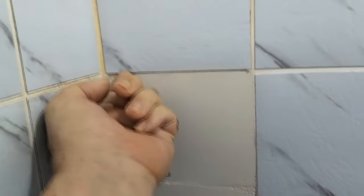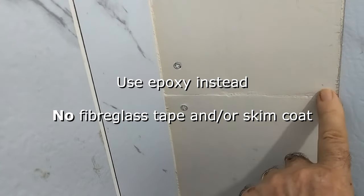Let's see what's happening here — let's get some light. I've been working here in the background and I've learned a lot actually. I assessed that all the tiles getting loose are over skim coating — no exception. No skim coating here: beautiful. Skim coating here: I have to redo. I prepared the surface this morning but I need to fix this one as well — I can see it's coming off a little bit. And that fiberglass mesh that I put in, I took it off — it is a problem, you can see it came off here as well.